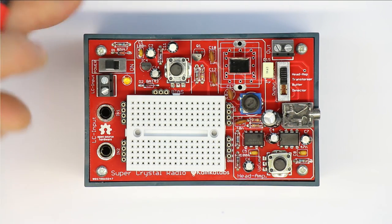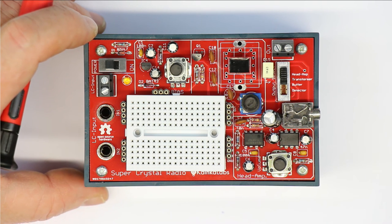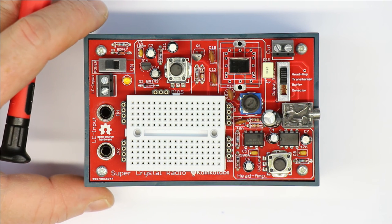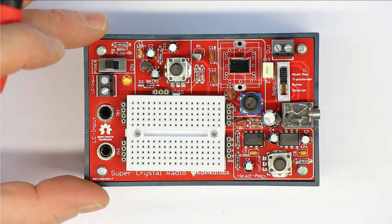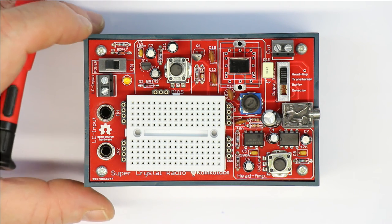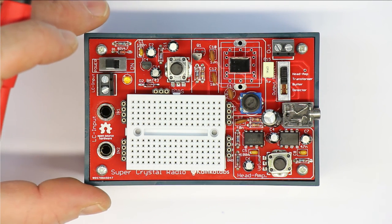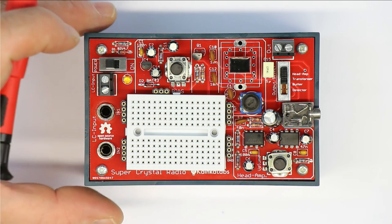I already mentioned today you have the problem you don't get any high impedance headphones anymore. Decades ago, it started with headphones which had 2 kilo-ohms impedance, but these are not produced anymore. For hi-fi listening, brands like Sennheiser or Beyerdynamic still produce 600-ohm headphones, but they are quite expensive. You can find older ones from the 1970s to 1990s relatively cheap on eBay. I will also give you in a later video episode some examples and a list I have compiled of readily available used 600-ohm headphones, but they are only the second best.